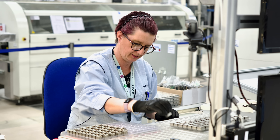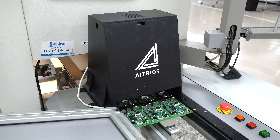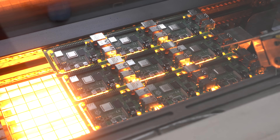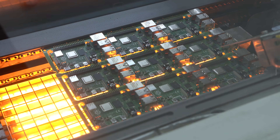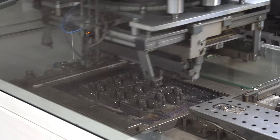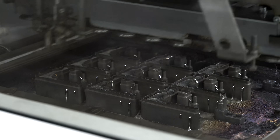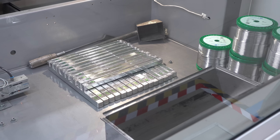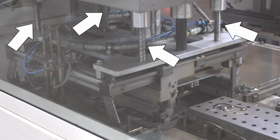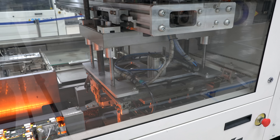These employees are an essential part of the line before the final selective soldering process. The next stage is selective soldering, where the board gets heated up to around 260 degrees and finally up to 275 degrees, making the solder molten. Solder is applied through individual jets to the through-hole components such as ethernet ports. This process is more directed than wave soldering, and it's a critical part of the manufacturing line. They have expensive blocks of pure solder ready to go into the molten bath, and a machine with four giant screws methodically dips the board in and slowly pulls it out, ensuring a perfect connection on hundreds of through holes.